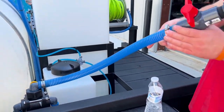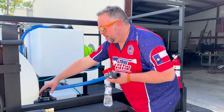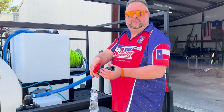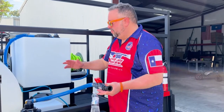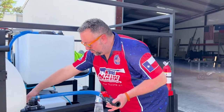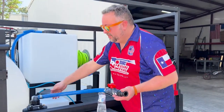Right here you see this is our bleach fill system we install. This is a three-way Banjo, 1-inch valve, poly. You can hook up your bleach tank to a 1-inch female cam lock and just open your ball valve right here. Once it's open, your system will start filling — and you only fill one tank at a time. Turn this handle right here and it'll switch and fill the other tank.